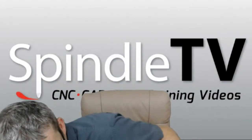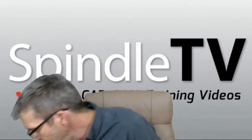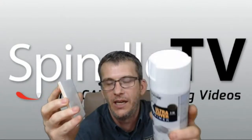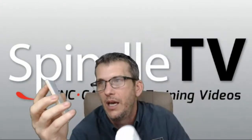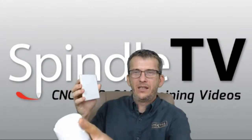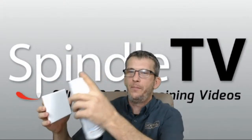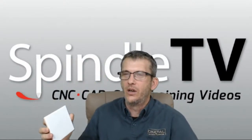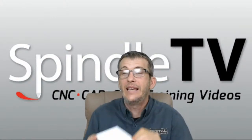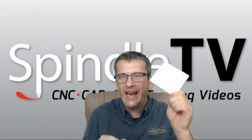So, I have the paint and I've got the tiles, right? Now, when it comes to the Norton method, when you're just laser engraving on the white tile, you're going to use the white gloss and just a nice, good, light spray cover. I want to call it 2 coats because I went nice back and forth at a nice speed, nice overlapping layers. And then I went back in the same direction. Right. So, technically 2 coats, right? Instead of one. So I did 2 coats. Okay. Let that sit overnight. It kind of dries in 2 hours, but I let it sit overnight.